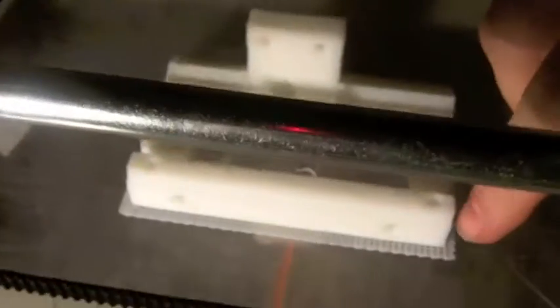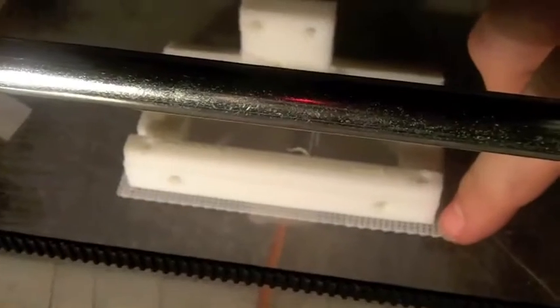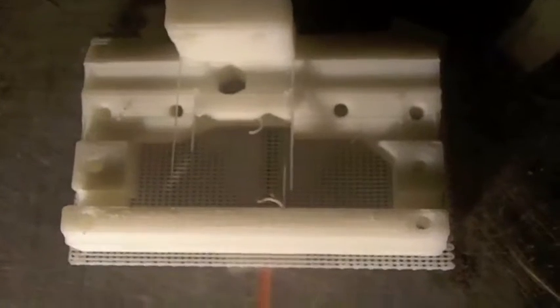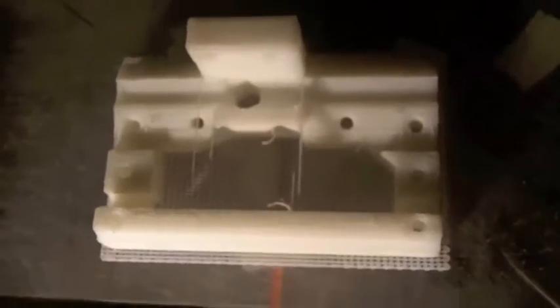The object is just finished - printed quite well. Only one of the corners is slightly lifted, about one millimeter, but that's quite good for a 10-centimeter object. I should probably clean the surface and set a higher temperature to avoid that.